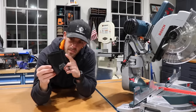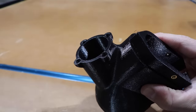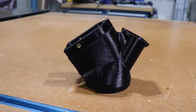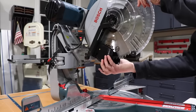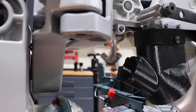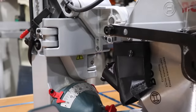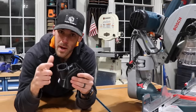For the next iteration, I shortened it up quite a bit and flared out the end to make room for the blade guard. On the back, I added the port for the suction and added a four-magnet flange for a quick disconnect for different size adapters — one of my goals is to make this work with pretty much any kind of hose out there. Overall it looked much better, but the most prominent issue is that the suction extends straight out the back in line with where the dust is generated, leaving not much room underneath the arm for the magnetic connections, so I need to reroute it to one side or the other.